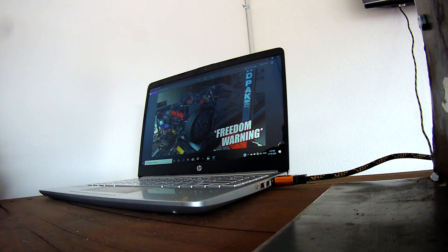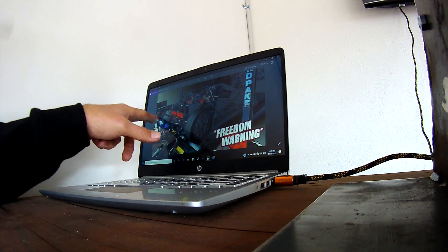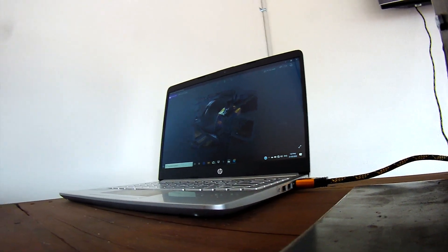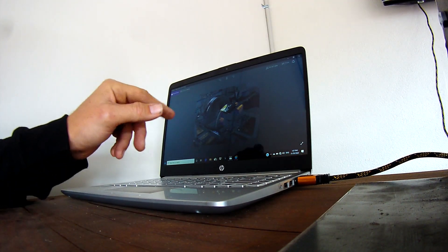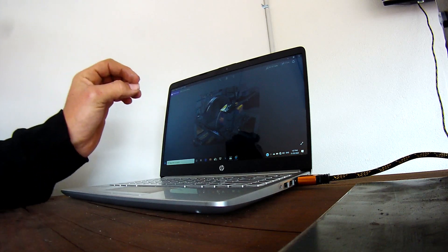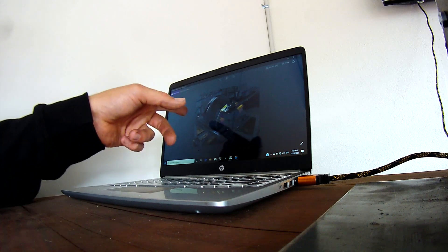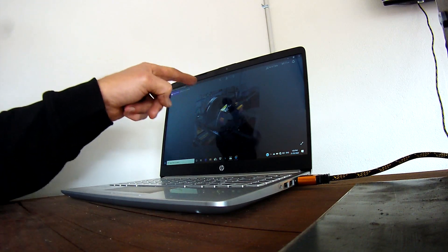Here's where we started — with Cletus McFarlane having a look at a full-size vehicle. You can see the tyres go onto the rollers; that's how we're measuring the torque of this particular engine. Way too big for our setup with a go-kart. Small engines have been running dynos like this for years. This is one type called an inertia dyno or inertia wheel dyno. All it's doing is having an engine — in this case a go-kart engine — turning a big metal wheel. You can make judgements about horsepower based purely on how fast an engine can turn that wheel.